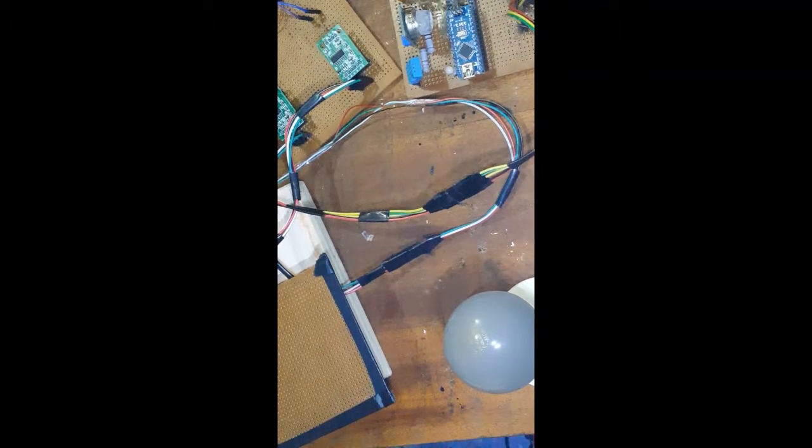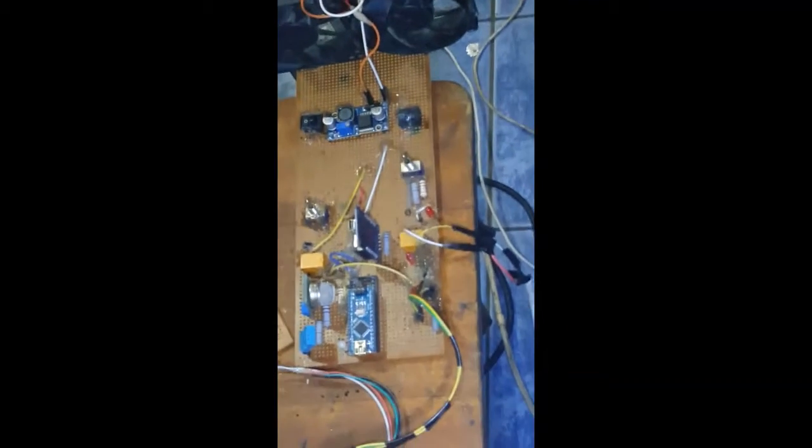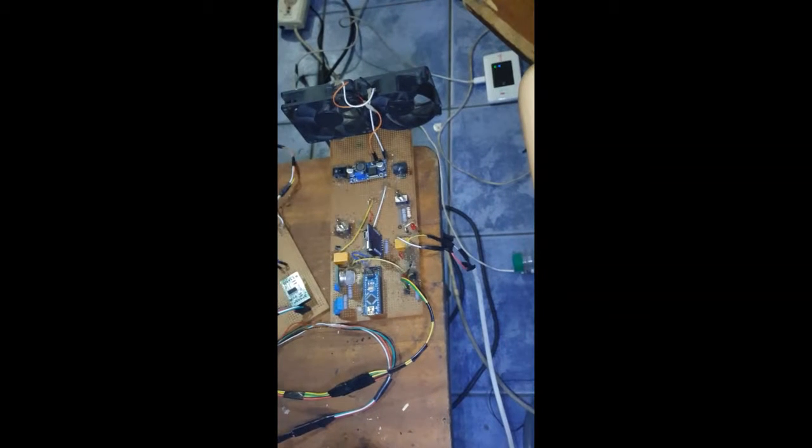Here, you see I have to adjust the camera a bit. Okay, you see that is node 1 right now. What you're looking at is node 1, and node 1 measures temperature and humidity. And when it measures temperature and humidity, it controls the infrared bulb, or in this case this ordinary bulb, and it controls the fan.